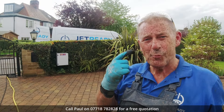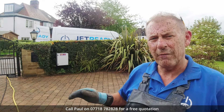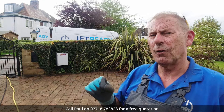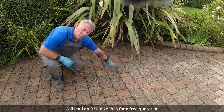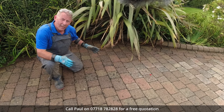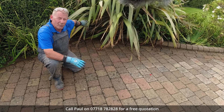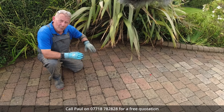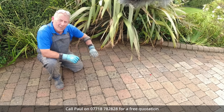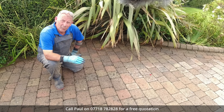That's a dirty job as you can probably see from my mug shot here. But it's come up really well. Pressure washing is very effective at removing surface grime, but it can't always get into those organic stains. All of these black splodges are actually black lichens. Lichens can form anywhere, but they're particularly happy in these dark, shady areas, especially if it's a little bit damp as well. Even with aggressive pressure washing it's very difficult to shift these, but we can dissolve them away with a deep clean alkaline foam. That's the next process I'm going to put into play.